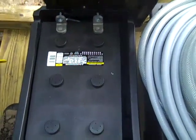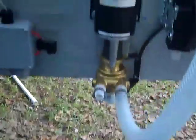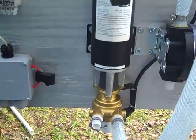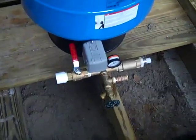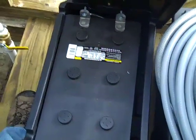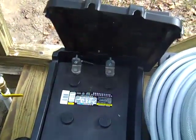This will provide a lot of water. I tell people to make hay while the sun shines — do a lot of your work with this pump when the sun's out, because the amperage of the solar panel matches the amperage needed to pressurize this bladder tank. That way I'm not taxing my batteries at all. But if I need water at 2 in the morning I can do it — it'll just use stored battery energy.